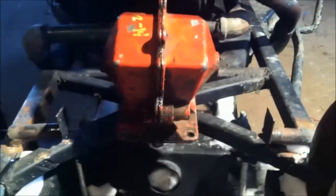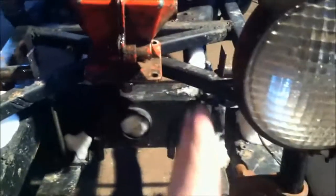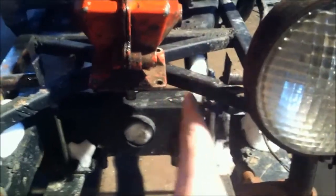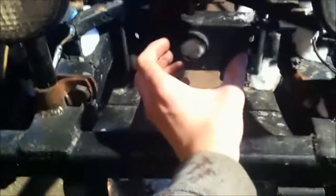You just grab the lever on the side, push it — it'll be on a linkage — and you can engage the clutch so the belt starts spinning. Put it in forward gear, then engage the clutch and everything starts moving. I'll have a chain coming from the 8 tooth to a 40 tooth — kind of like a jackshaft. And I'll have the drum sitting right around there, and then I'll have the winch.